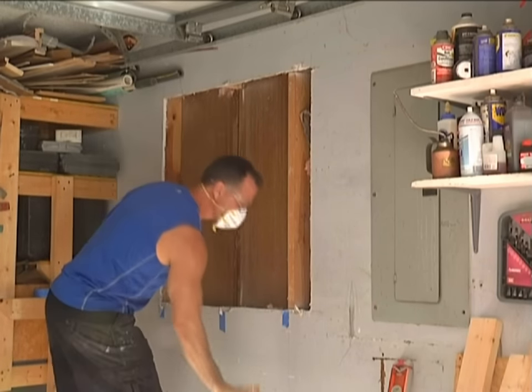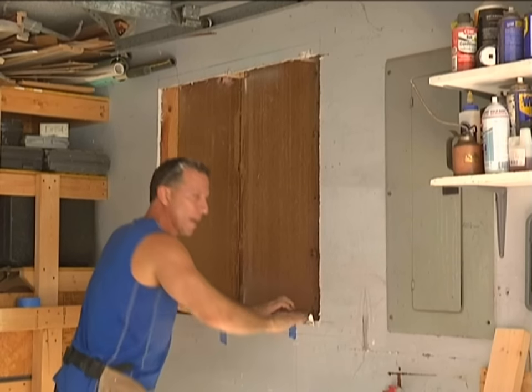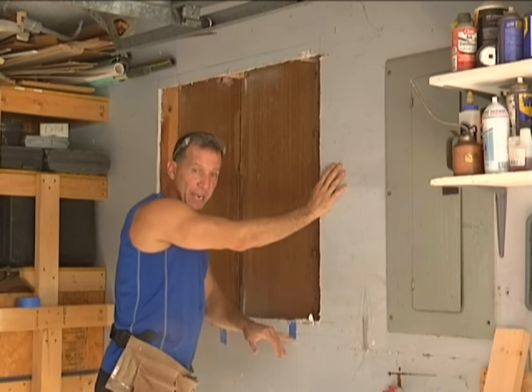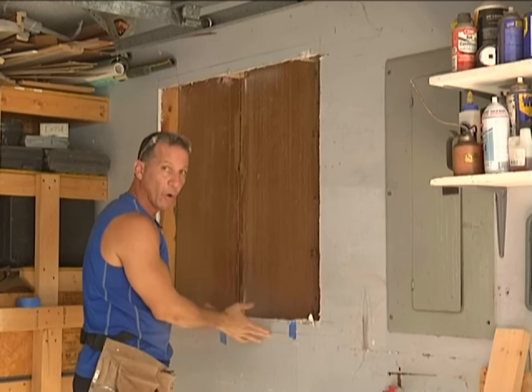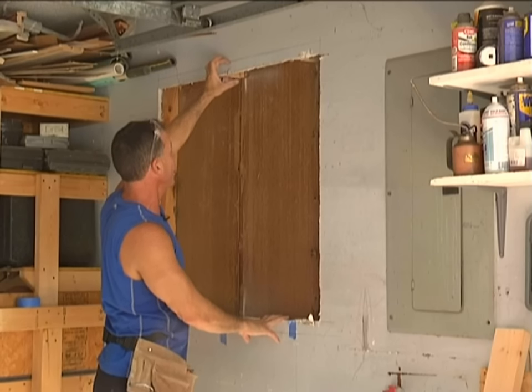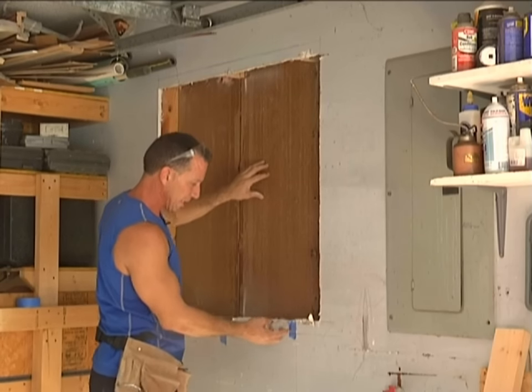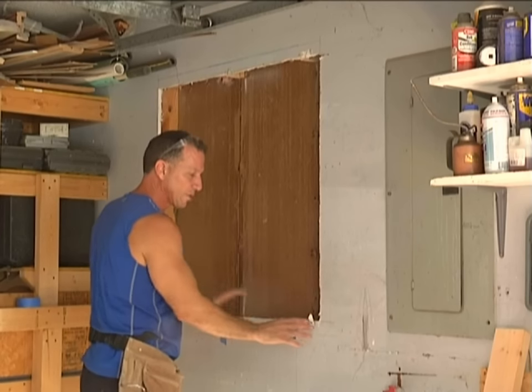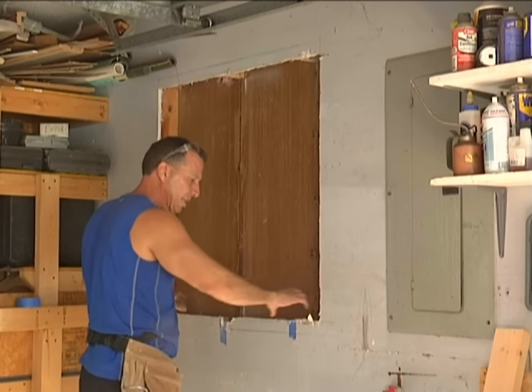That's all she wrote. I made my cuts across here on purpose — not cutting the bottom yet — because I want to leave as much drywall as possible. I'm going to come back with my reciprocating saw and cut a line right here, here, here, and here and drop these out. That way all my drywall can stay in place and I can tuck this right behind it.